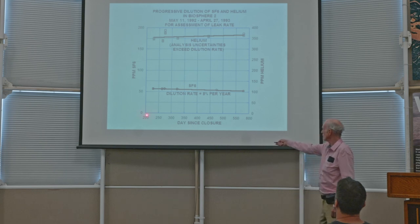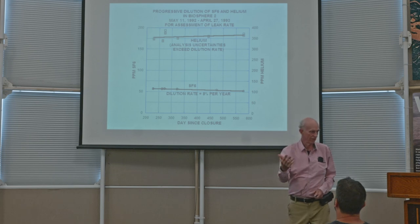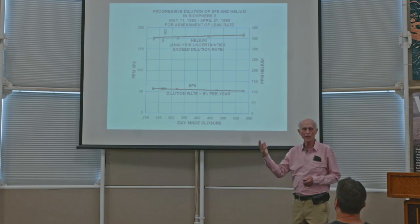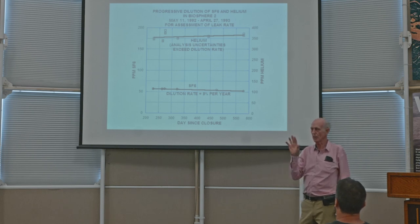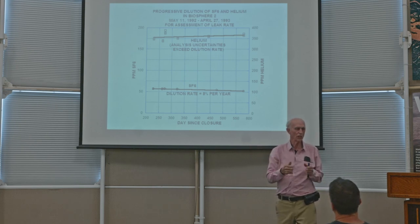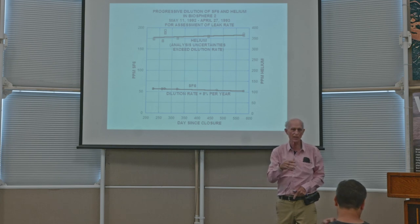So this is number of days, 200 to 600. Well, okay, 230 to 580. So in other words, for a year, we would measure the concentration of helium and sulfur hexafluoride remaining in the air. Because, and I need to back up for a minute, when I talk about a leak, I'm not talking about a leak just outward or just inward. I'm talking about exchange of air between the inside and the outside.